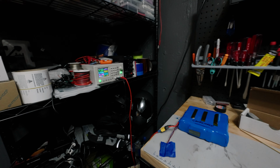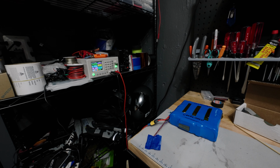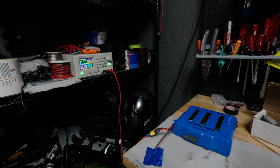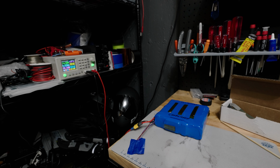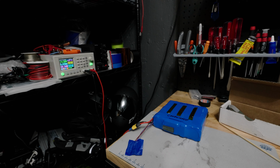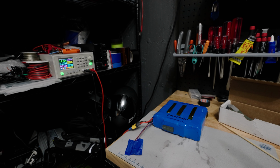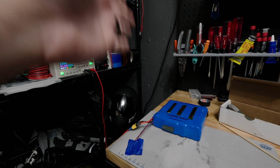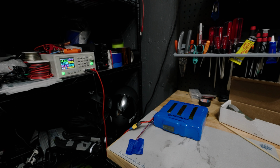And so doing this is something that you should not do. I really don't think anyone should recommend anyone else do. If your battery has been sitting flat, condemn it, recycle it if you can, and begin the very painful process of trying to figure out how to replace it and proceed from that point. Reviving batteries and recovering lithium-ion batteries is something, in my opinion, you should never do. It is not worth the risk.